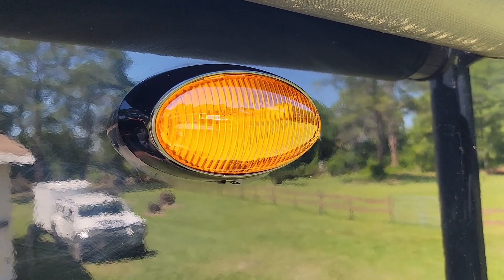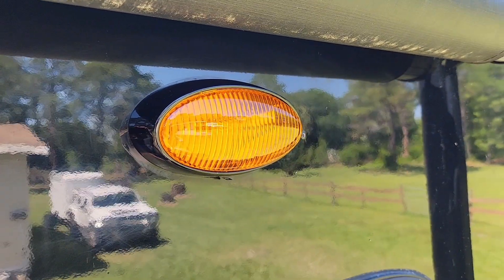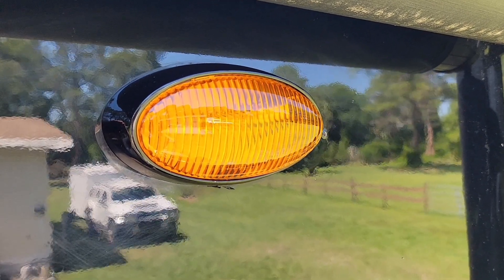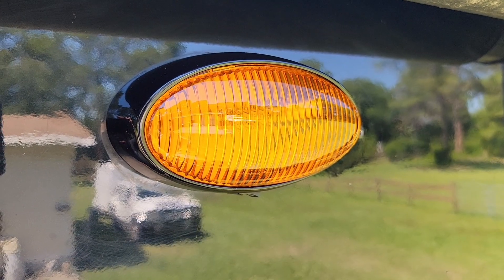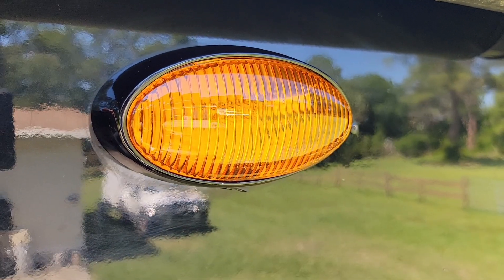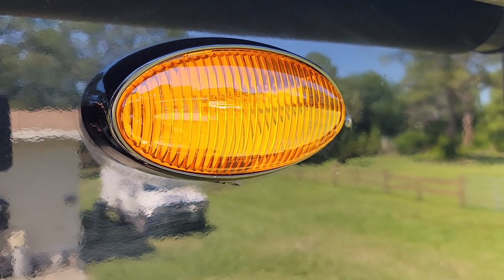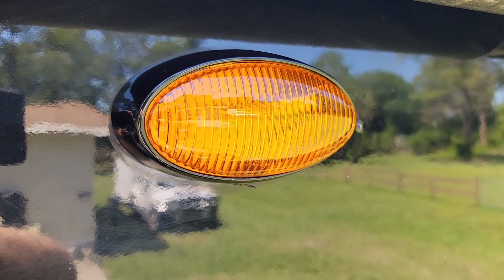Did the bulb, put the new lens on. I had to clean it up and polish a little bit more around it because the thinner breaks everything down. Good test and good advice for the future — I'm glad I tested for power before I kept going, and then I tested the switch to see the light. It is LED. New bulb, all good. Final thought: LEDs have to be run in one particular direction. But if you do it the right way, even if the colors don't match and you get confused, when you find the right way — let there be light. Has anybody had anything like this happen? Because this one drove me a little bit nuts. Let me know.